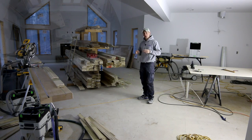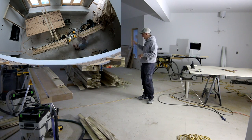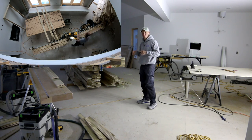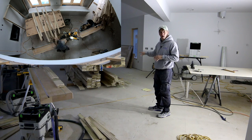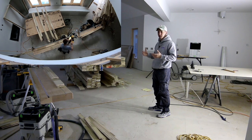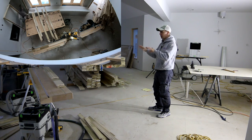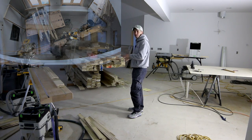The first thing I want to point out — I cannot stress this enough — is logistics and job site setup. Here behind me I've got my trim rack, loaded down with trim. All my casing is on the lower level. New construction trim efficiency is all about reducing footsteps and efficiency of motion. You want to have your trim in the house close to where your saw is going to be. I can see how close that trim is to my rack — I'm not wasting footsteps running back and forth.